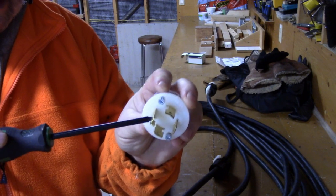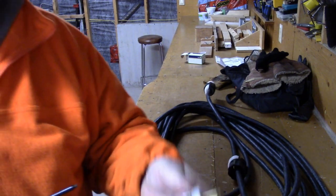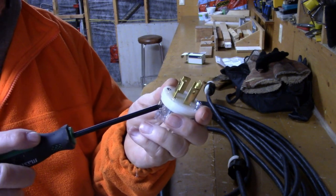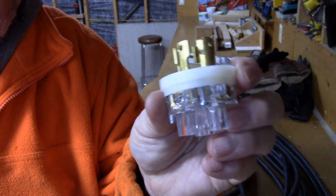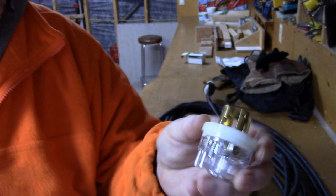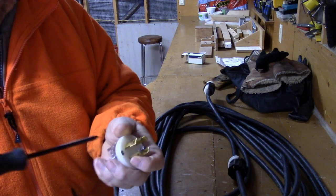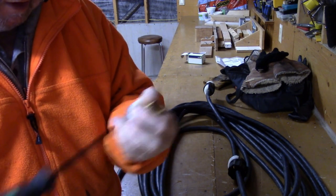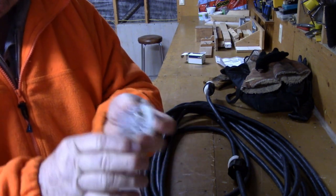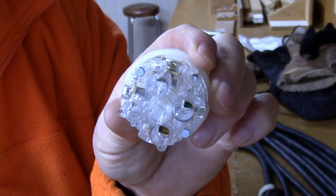Green is always ground. If you read the instructions, you'll see that the brass colored terminals are for your hot leads and the silver colored terminal is for the neutral. Can you see that that's silver right there and that's brass? And they're all green Robertson screws this time - isn't that slick? What I like to do is just loosen those off so that in the innards of the plug there's good access to put the wire leads in.